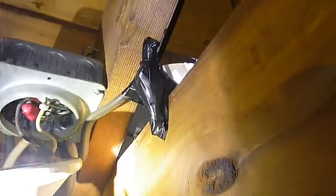The indoor air handler is located in here. The attic light is inoperable — it's dangling. And then we have some open electric junctions right there, improperly made.